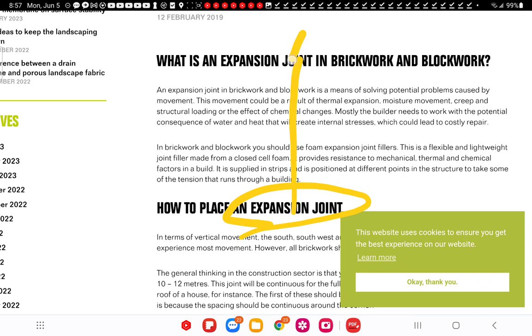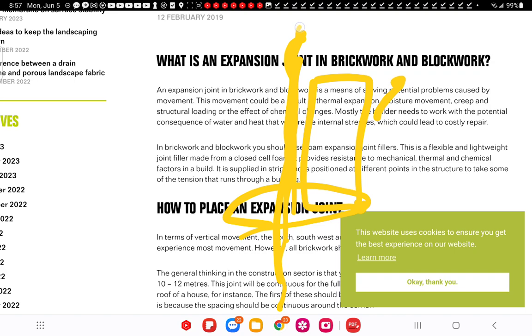I showed you the corner of the structure where the bricks are. The other wall, the opposing wall going down an alley, has a crack going fully down there, not the foundation. There is indication of thermal expansion. This wall was not rotating away. It was pretty plumb. So that looks like a nice one. Now, you do have to put a backer rod in there and you tie them across also, and then you put a Sikaflex product on the face of it. There's many products, rubber-based products even, that will work between the bricks.